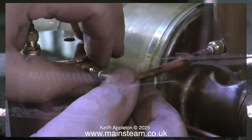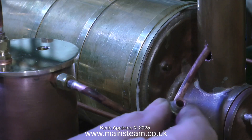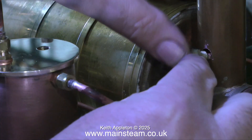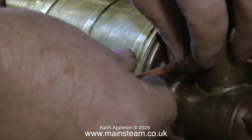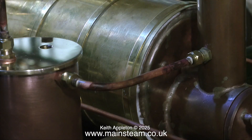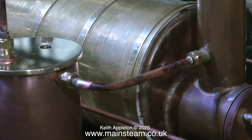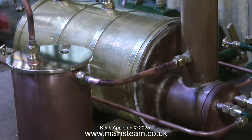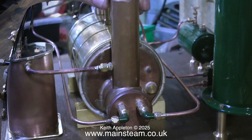After the silver soldering is completed I put the pipe loosely in place on the condenser, then move it out of the way to put this little piece in — the pipe that goes up the chimney, which just fits nicely and presses into the hole. Now the main pipe from the condenser can be fastened both to the chimney and the condenser. No other securing method is required for the fitting in the chimney, because once the condenser is screwed to the baseboard and the pipe is tightened onto the condenser and the fitting, that's all that is required to hold the fitting with its pipe up the chimney securely in place.